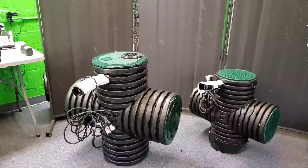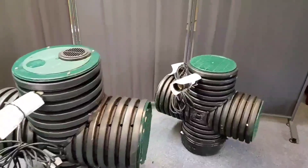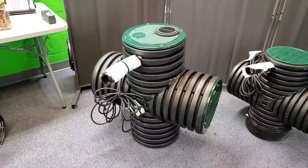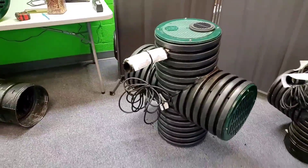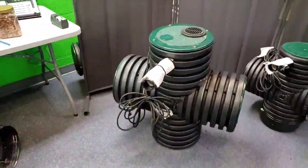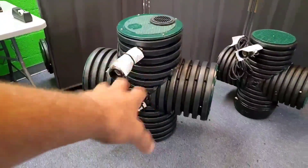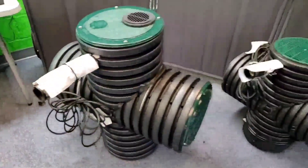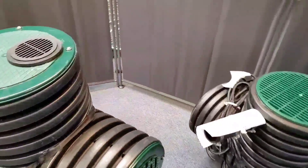I wanted to do a side-by-side comparison between the Screamin' Demon full frame and the micro Screamin' Demon. Depending on your water problem — how much water you're going to have rushing to this sump station — if you're looking for something that's going to hold more water, the full frame has a 30-inch chamber and stands about 31 inches tall, so it's a little bit more of a dig than the 25-inch tall micro. The Screamin' Demon micro is 25 inches, the full frame is 31 inches. You've got a 24-inch chamber on the micro and a 30-inch chamber on the full frame.